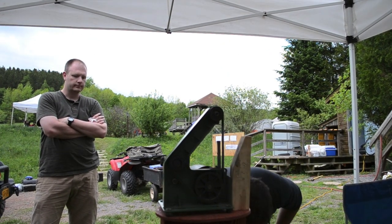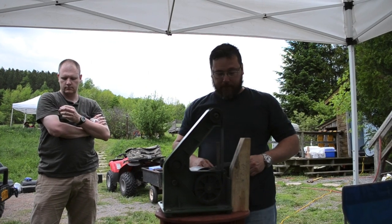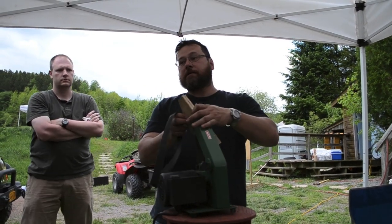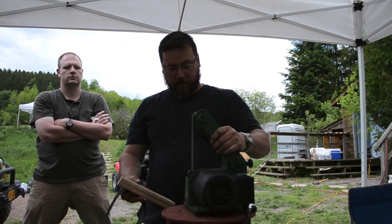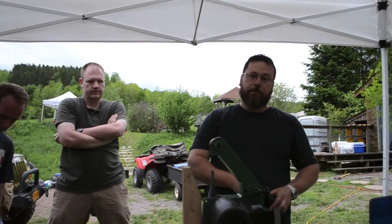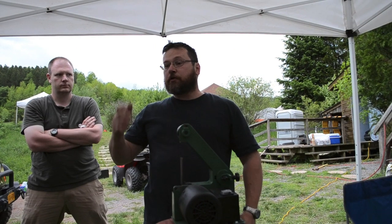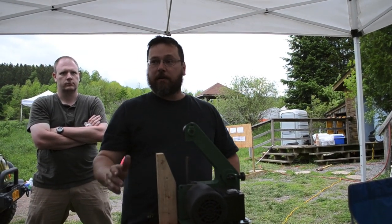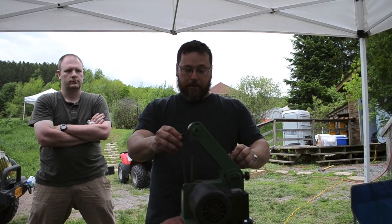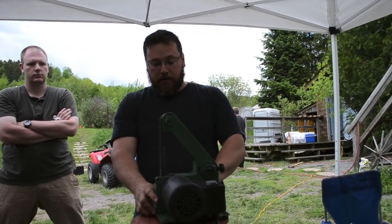We've done 800 and it's good, so now we go to 2,000. You can go to 1,000 or 1,200 if you want — whatever you have. But if you go to 2,000, you can't just make a couple of passes; you've got to stay longer with the 2,000. At the 2,000 grit level, you stop the paper test because it won't work. The reason is the edge is folded over — you're shaving tiny things off and the edge becomes very fine with little chunks of debris on it. From 2,000 you go to leather, and the leather basically clears out all that debris.